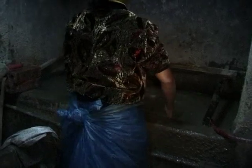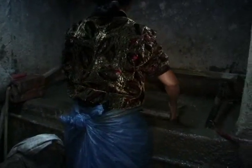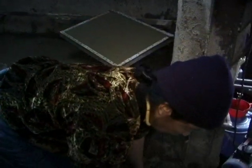The process of making the recycled paper here is exactly the same as we had witnessed at the Dong Hoa Collective 13 years previously. The papermaker is Mr. Van Duk's daughter-in-law, and she uses a flat woven screen mold and couches each sheet onto a thin cotton cloth. The sheet formation is just a quick dip into the pulp, and that's all. The couching of the sheets seems to be a two-person affair.